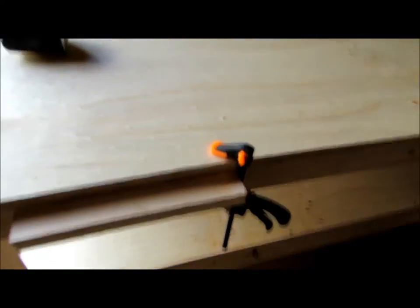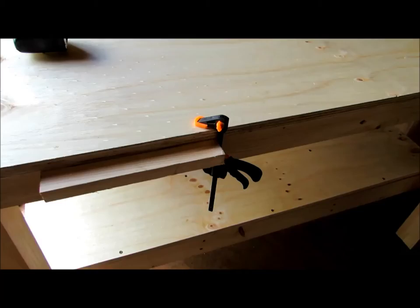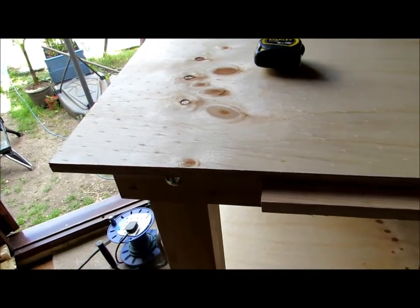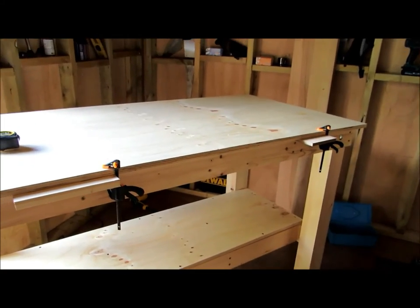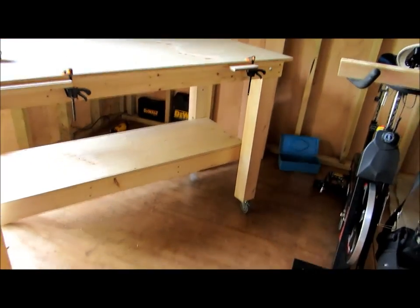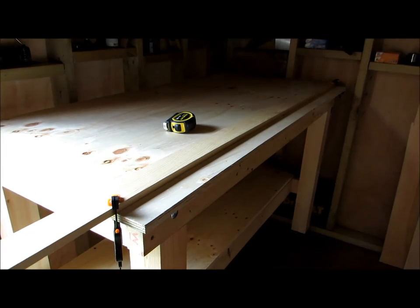So there are my little chocks - the distance from the line here up there is four centimeters. I've pushed that very gently because I've only got two clamps, so one here, one there, and that can easily be knocked out. Very, very gently slide that on - I just need to adjust that, it's almost up to the support underneath. It's far more overhang here than it is over the other side, so let me just slide that along and just make sure everything's square before I put any more screw holes in anything.